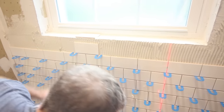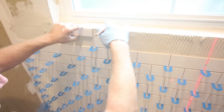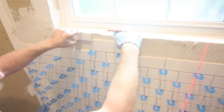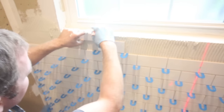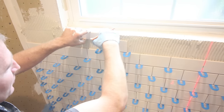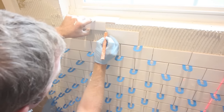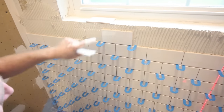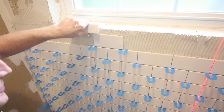We're going to allow this to stick up past our tile, proud of it, so that we can apply a thinset underneath of here and then fill in the pieces to meet up with our bullnose afterwards. This is all pretty flat, but it's just going to be easier to have uniform cut pieces since this is all level. Allow enough for thinset — you can always build up your tile on top with additional thinset to come out even. So let's just make this two-and-a-half inches for this whole row, place our bullnose, and then fill in our sill afterwards.